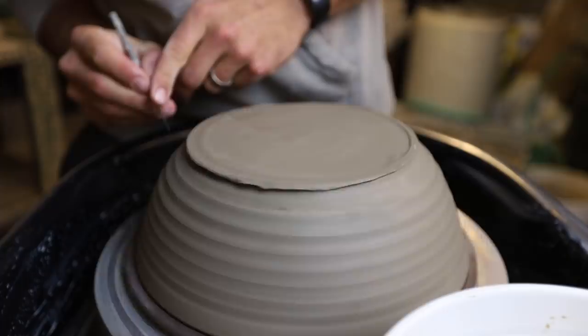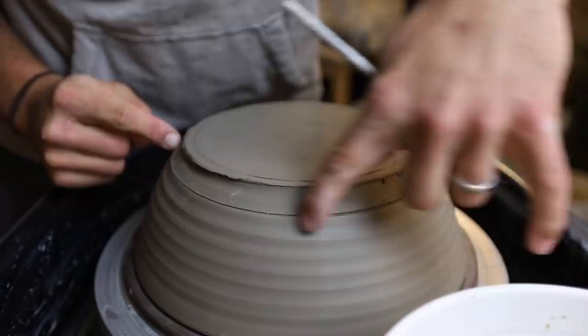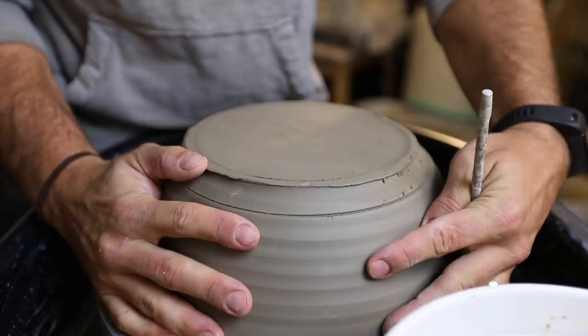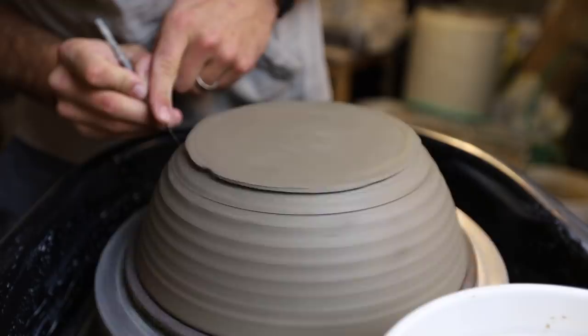Can you see and hear that? From right here all the way around to right there, the needle hit and it did not hit on the other side. So then I know it's too far that way, so I'll just slightly move it. Then I'll do that again, and now I can hear it — the needle is hitting all the way around. So now I know it's centered.